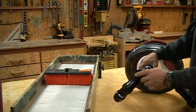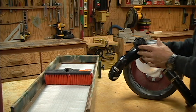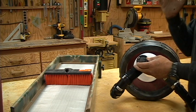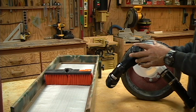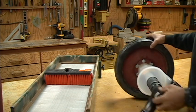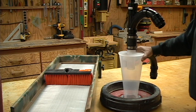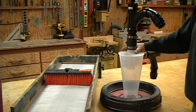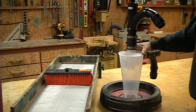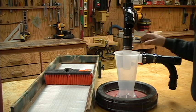On this end, on the top, this is the filler cap — this is the highest point of everything. When I fill up the whole system, the tub is going to be lower than all of this. When the tub gets up to the right level, I have a valve on the tub I can shut off to hold the vacuum, then fill up the whole rest of the tank and the hoses all the way up to here where it's coming out. Put the cap back in, open the valve to the tub, and I should have pretty close to maybe a bubble or two left in the system to start it going. If this thing works out and is promising, you can make them a lot bigger. Cyclones get up to a couple hundred bucks when you buy them in steel, but it shouldn't be too hard for someone with decent sheet metal or aluminum skills to fabricate this stuff. The geometry and relationships between the inlet and the downpipe are pretty much set.